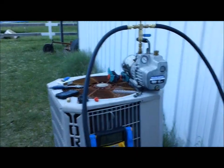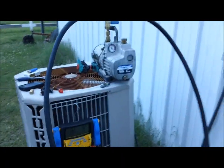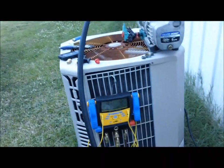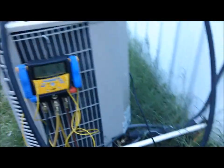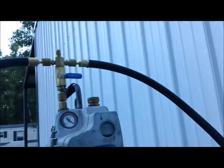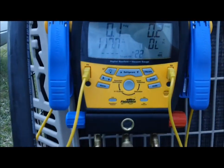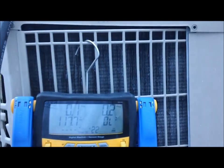Today we're taking a page out of Fritz's book. This is the system on our shop - we don't use it that much, so it's a good one to experiment with. We've got the T, the half-inch Appion hoses, 3/8 up here, quarter-inch down here, and the Schrader core removers in with the cores out. We're using the S-man as the micron gauge.